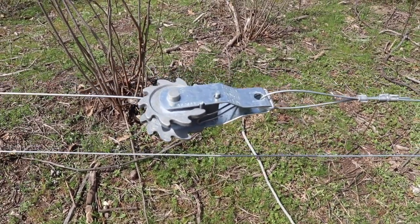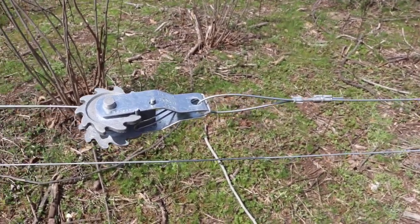The next thing was how to get your fence really, really tight. There are different methods — some people buy little attachments for a come-along, some use a wire tightener, and others use the ratchets that actually go into the wire. Hands down, by far, the easiest and most convenient way is to use those little ratchets that go into the wire. You get them at Tractor Supply or wherever, and they ratchet down — you buy a little special tool to do them with. It is so simple, so easy, so slick. They can carry an electric current right through them, so there's no need to splice a jumper around it. You can also come back and adjust later, so you can adjust the tension as the weather makes the metal and wood contract and re-expand. If you have that ratchet on there, you can make adjustments.